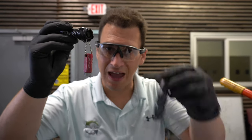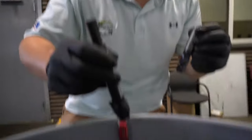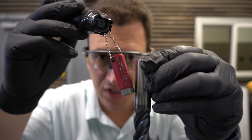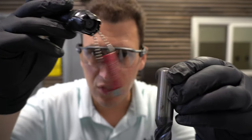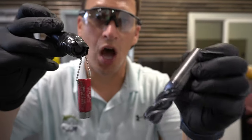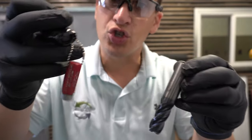If you're looking for a bonus on carbide, here it is. Have your magnet and have your carbide. If this was steel like this barrel is, you would have a really hard stick with the magnet, but with carbide, watch what happens — you have a very slight pull, but the magnet isn't going to really stay on there. That's because the properties of carbide will promote slight magnetism. A slight magnet attraction is good; a hard magnet attraction is bad.